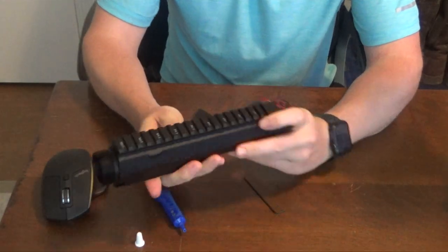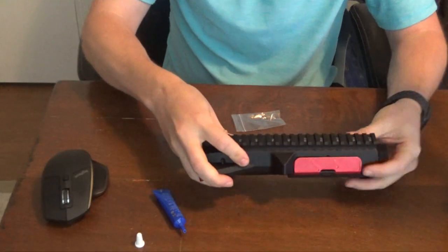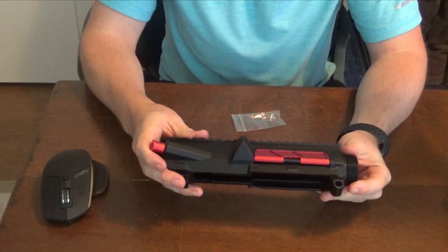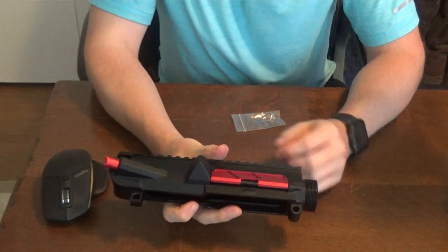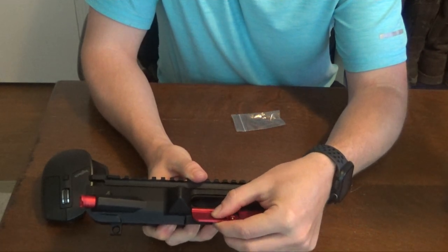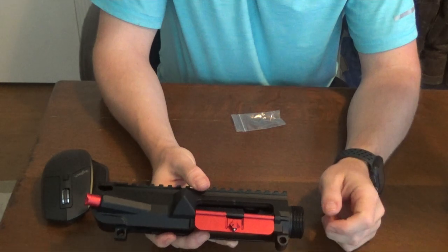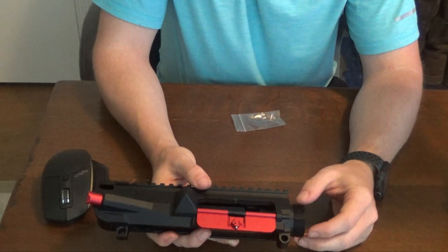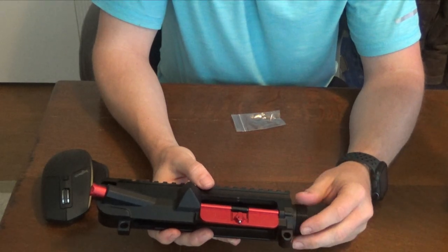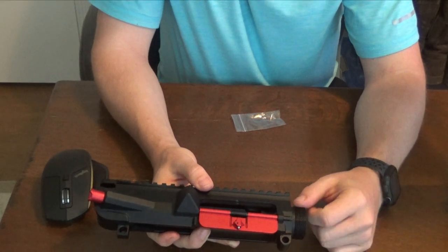That's really all I have for the upper receiver. You can go ahead and attach this to your lower receiver if you want. One note as I'm going through this build: the AR-10 does not have all standardized parts, so you may run into some issues. For example, I can tell that the rod that came with this Timber Creek is not long enough because it does not go all the way through — I'm going to have to buy a separate rod for this specific one. I'll probably look at the Aero rod and just buy that.